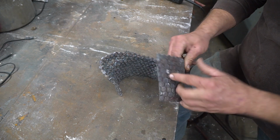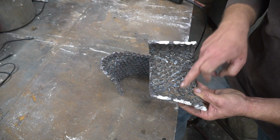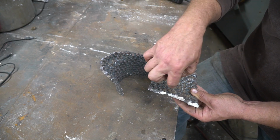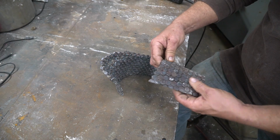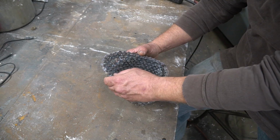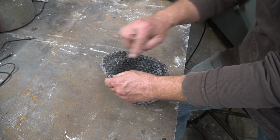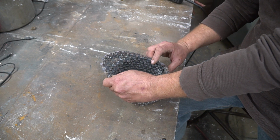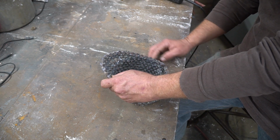See, this one right here is off. It's welded solid, so I could either drill it out. Grinding it out sucks. I would drill it out with a bigger drill bit than the bolt head size. Or in this case, I'm just going to weld it solid. It doesn't matter. It's going to be best to keep the tops flush, since they were both in the top of the form. Yeah, I'll keep the tops flush.